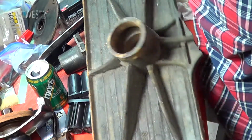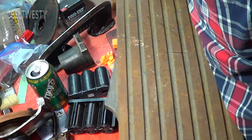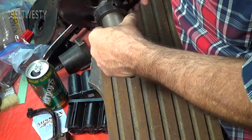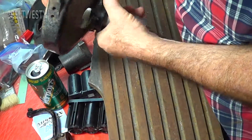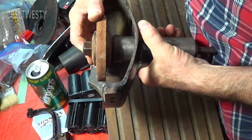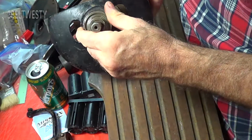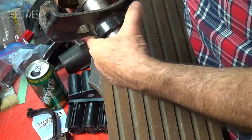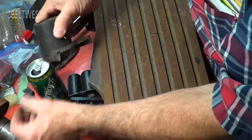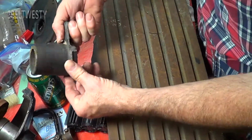And this particular one cracked here. What's interesting about this is the whole unit had set screws on here, so you could adjust the Z height to be anything you wanted for any different type of holder, modern or ancient. On the unit here, it actually has a fairly beefy frame, but this was the weak point on here. It looked like I had a fatigue crack, and this cracked at one time.